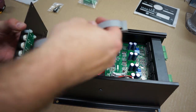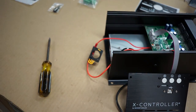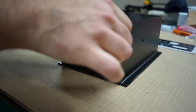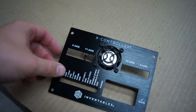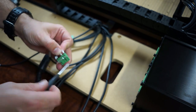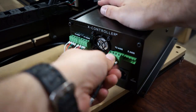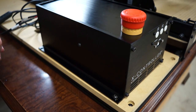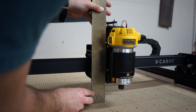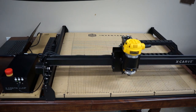The buttons went on really easily. After that it was an exercise in plugging in various cords into their correct places, screwing things in, making sure all the terminals were good to go, and putting it all together. The top slides into place, the emergency button gets connected, and then the front plate gets screwed on using a screw in each corner. The back plate was just as easy — screw on the little fan, a screw in each corner, and it's good to go. Wiring up all of the terminals was again very easy; just follow the instructions carefully and you shouldn't have any problems. Just remember on the Y2 axis you need to swap those two wires so that the motor spins in the opposite direction so that both sides move the same way — that's super important. After that we bolted it down, and it was time to calibrate. The table was spot on and perfectly level, but the gantry was a little out of square, so we had to go back and readjust those bolts we mentioned earlier. Finally, a moment of truth to make sure the motors and homing switches worked — and they did.